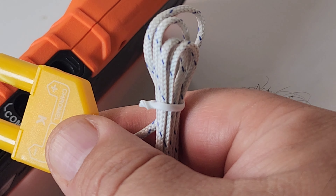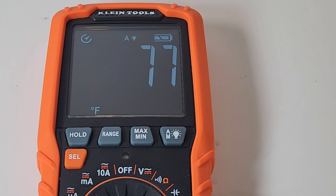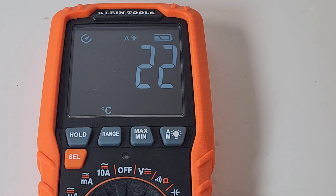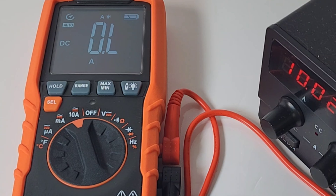No ambient temperature sensor on board, so you do need to use the external temperature probe. That being said, sitting here in the lab at around 72°F. Hit that select switch for Celsius, coming in at 22°C. Current mode: sitting at 1.9 amps — coming in at 1.9, looking good. Taking it up to 7.4 amps, coming in at 7.6. Maxing out at 10 amps — we have an over-limit and audible alarm, which is always a good thing. Bringing it back down, 4.8/7 coming in at 4.9 — just a tad high, but it survived. In milliamp mode, precision is good: 100 milliamps, spot on.